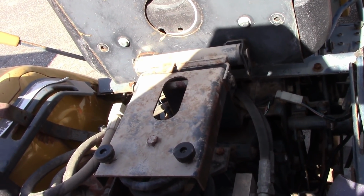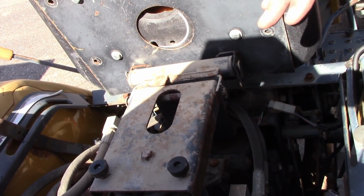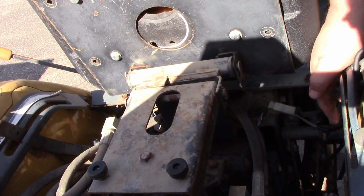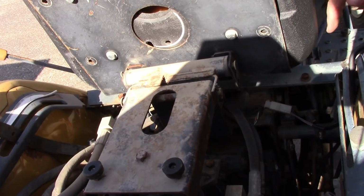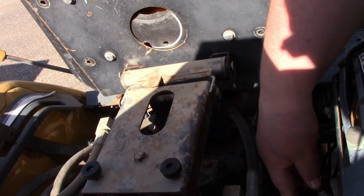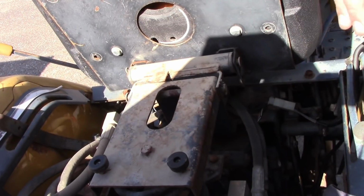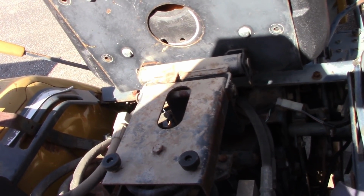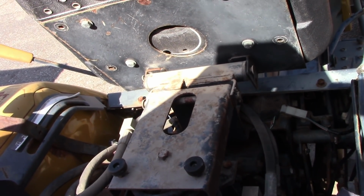So I'm gonna have Junior Mint pull the seat. He's probably gonna have to pull this fender and this stuff off to get the end of this off, because there's a snap ring and there's just not enough room. I'm gonna have him re-weld that and fix it, and then have everything in the back oiled and greased and lubricated in every possible way, and try to get everything moving again.